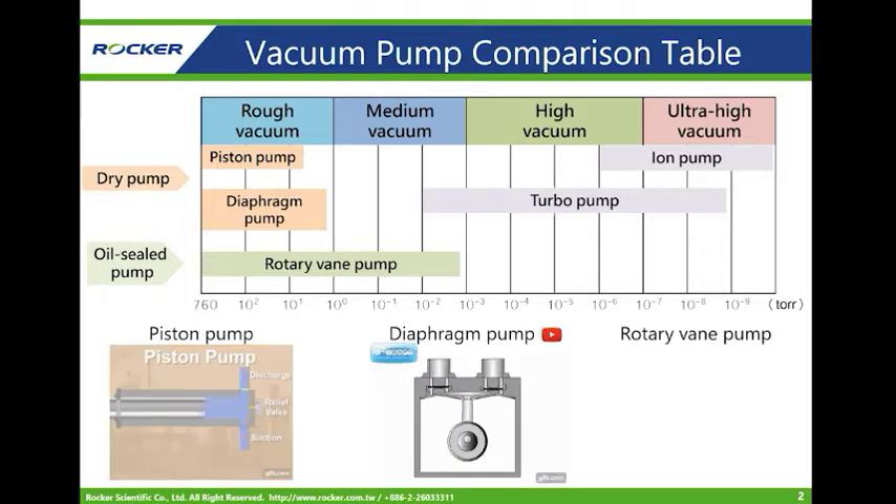The next one is the diaphragm pump. The Chemker series pump and liquid pump are diaphragm pumps. The diaphragm separates the interior into two spaces — the upper space and lower space — and it can protect the connecting rod from contacting the carried air or liquid and prevent possible damage. That's why chemical resistant pumps and liquid pumps commonly use a diaphragm.